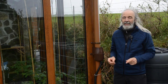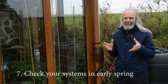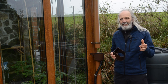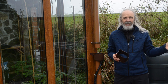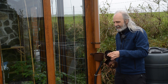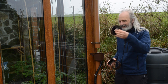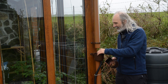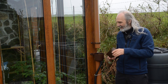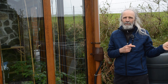My seventh tip is that in addition to clearing your gutters and filters in the autumn when they're likely to be full of leaves, check them again in early spring. You don't want to get to summer and realise your tanks haven't been filling up because there's been a blockage somewhere. These diverters have a filter and we check them regularly — just done them recently, hence why they're clear. But they can be full of woodlice, lichens, sticks, and such. It's good to check now while there's still plenty of rain to fill them up for summer.